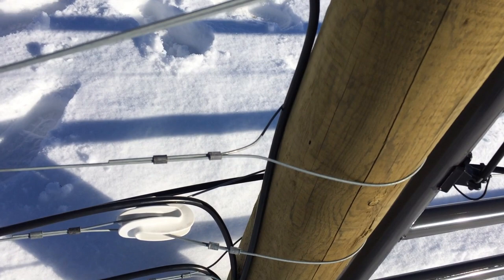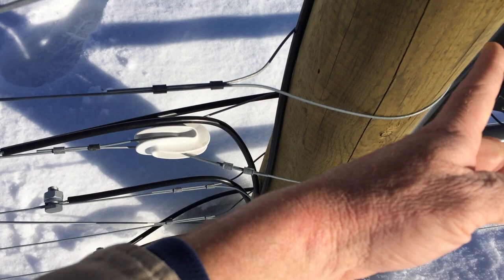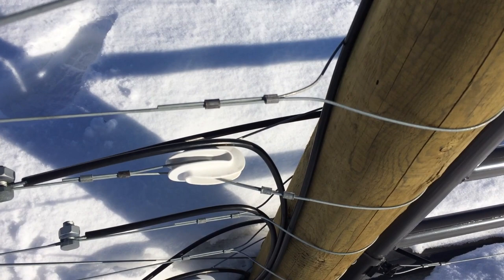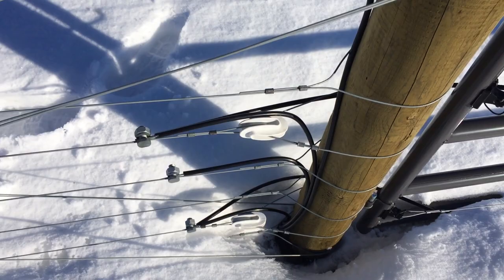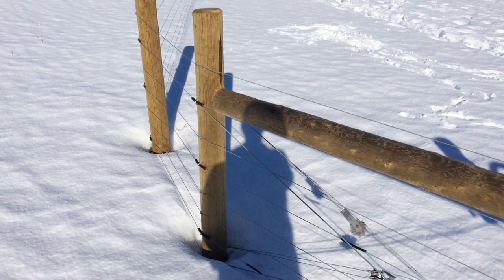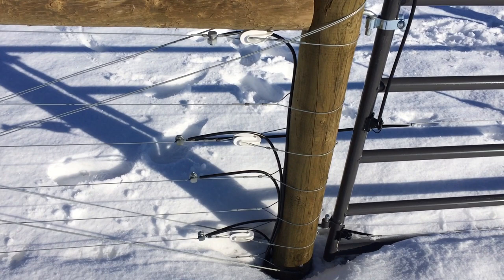On the first gate I did, I tried to make the wire come off the front of the pole so it was straight right here — I went around the back of the pole and then had a bend in just the back of that wire. What that did was take my pole and twist it with the force of the fence, basically moving the post even with the H-frame on it because it wants to balance out all the forces. That was one thing we learned. Making sure your string lines are on the right side and that you're coming straight off the middle of the post with your terminations — not off the front or back — was an important lesson.